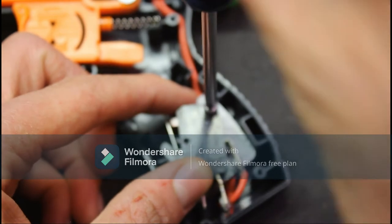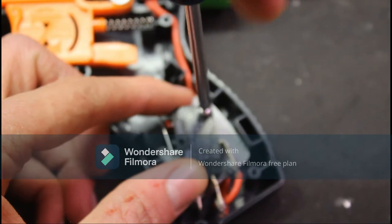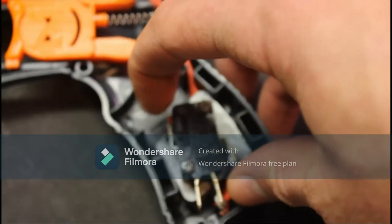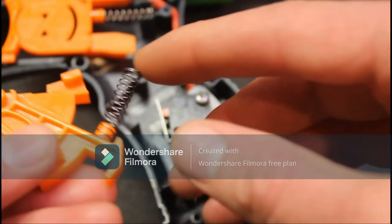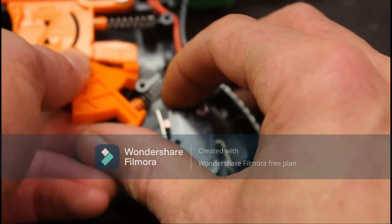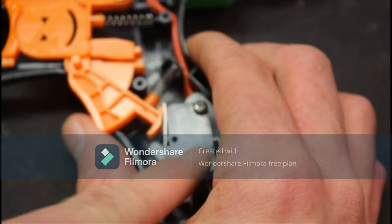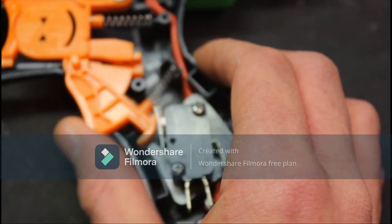You can choose to glue down your switch plate into the Spectrum grip if you'd like — I find it stays in place just fine without glue so I leave mine. One thing to note is you may need to trim the lever arm depending on how long it is so that it does not interfere with the return spring on the rev trigger. You may not even need the return spring if your switch is clicky enough, but I like to glue it back in anyway. Test it — activates nice and clicky.